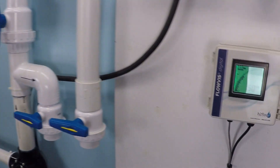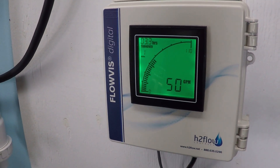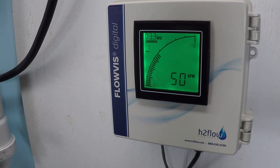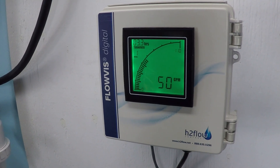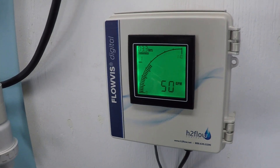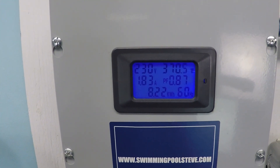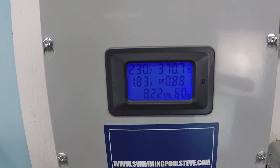This is approximately half speed. You might say half speed won't be very much — but 50 gallons per minute is actually a lot. Crunch the numbers: if you're filtering your pool at 50 gallons per minute running 24 hours, that's a huge amount of flow. And we're still at just 1.83 amps — that's very little. 370 watts. Not very much power at all. It starts to consume a lot more power as we get towards the high end of the scale.